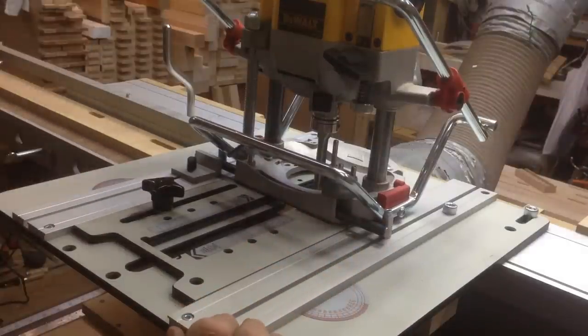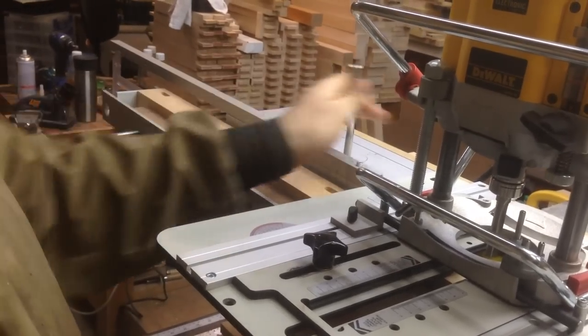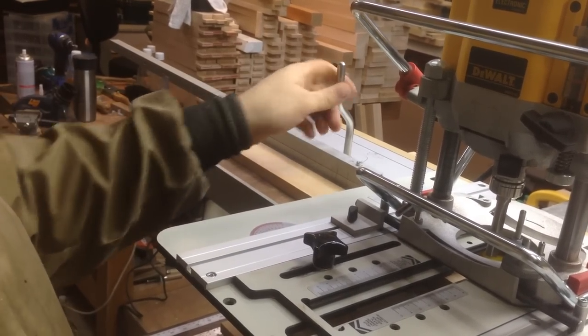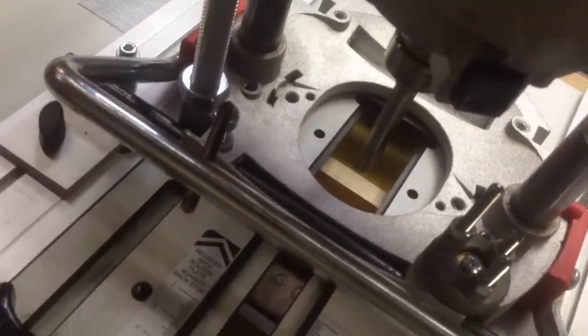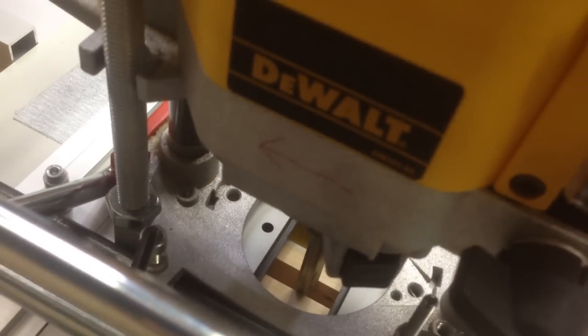To move to the next stop, I come over here and release the stopper down here. Then I move, looking at my points, until I'm in between there again. I release the stop, so now I'm trapped between those two stops. Then I look here and see that it's pointing one arrow — one arrow means the middle position, which is that position there. I'm going to plunge just a little bit and put the stop on. You can see down in there that it goes from one side to the other, hitting the stops.